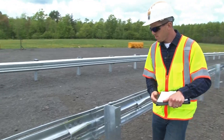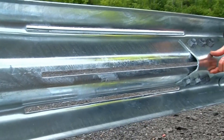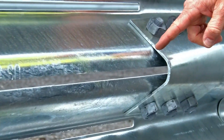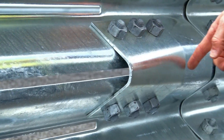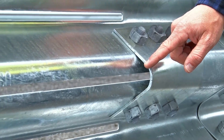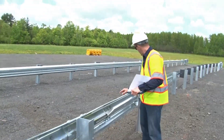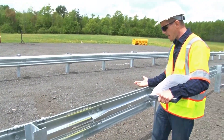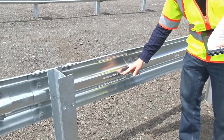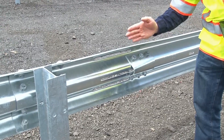Taking a look at the back of the rail: each set of slots has a slot guard. Make sure that the slot guard is on the side of the slot furthest away from the impact head. Make sure that the deflector gap opening — you'll see that one side is flush up against the rail and the other side has an opening — make sure that opening is pointed toward the impact head. At rail number 2, make sure it is not installed backwards. You'll know it's installed correctly if the slot guard is on the correct side of the slots — that's on the side furthest away from the impact head, with the opening pointed toward the impact head.